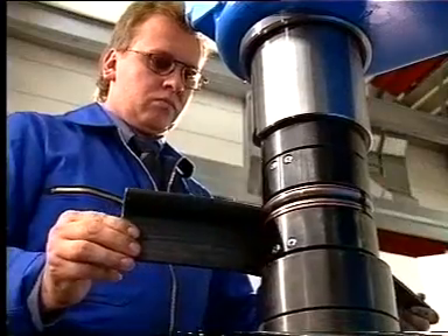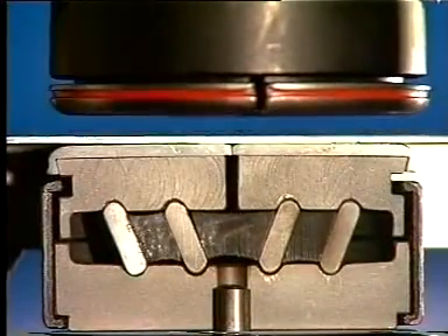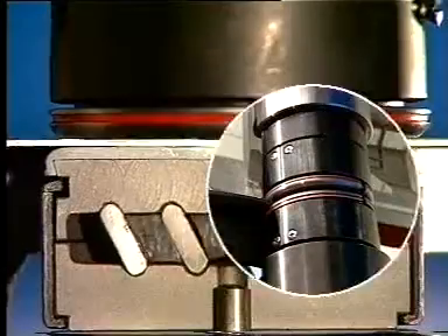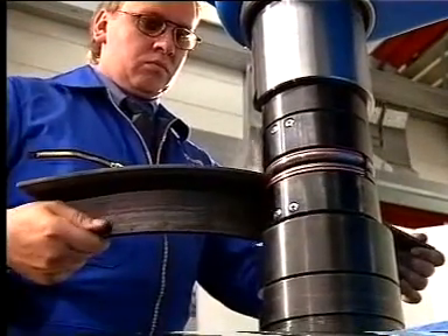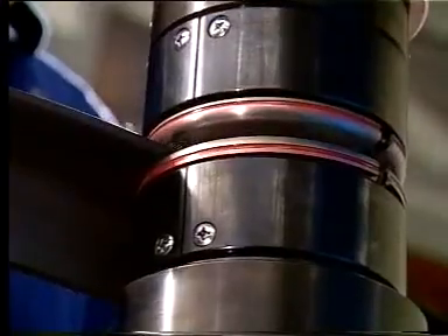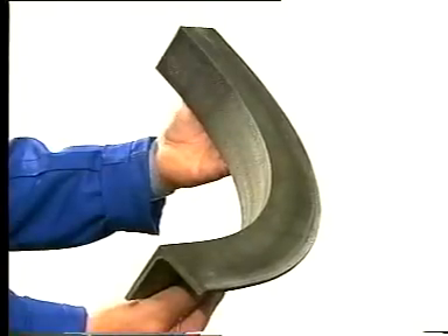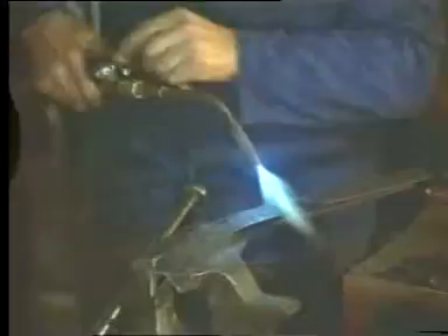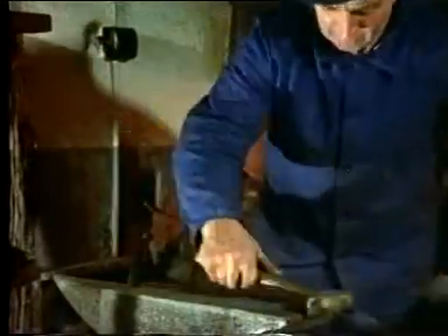In stretching, the tool elements work from the middle outwards as they stretch the workpiece material precisely step by step to the desired form. The corrugated and hardened upper surfaces of the tooling elements grip the material of the workpiece and force it into the stretching direction. A flashback shows the conventional but now almost historical method of heat shrinking with bending and beating out the wrinkles in a series of time-consuming operations.